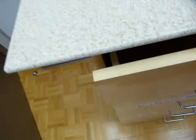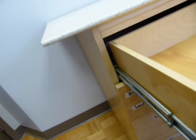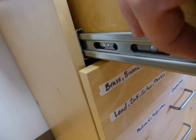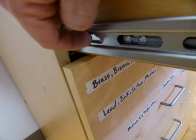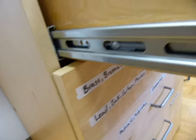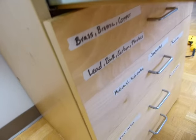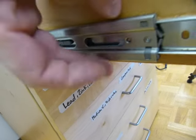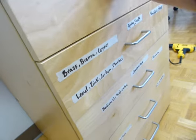You just have to make sure that they mesh together all the way, then check it — extend it. The steel ball cage has to be moving. It is now. So it's all the way out at the end here. We know that it's in here centering the drawer slide. That's nice on that side.